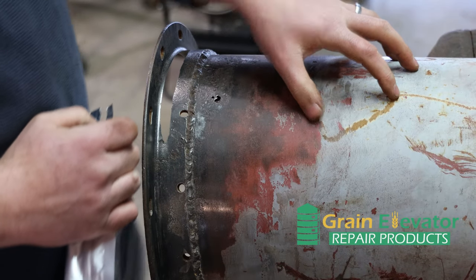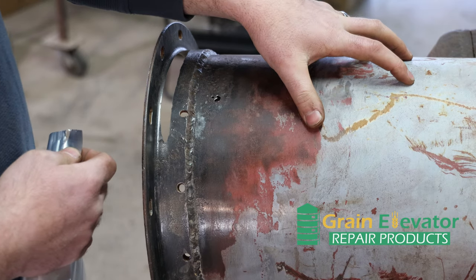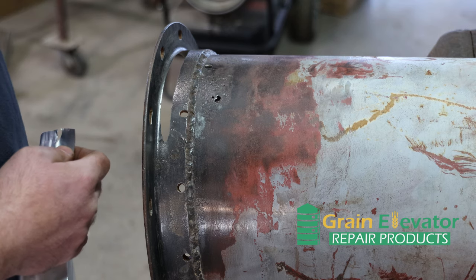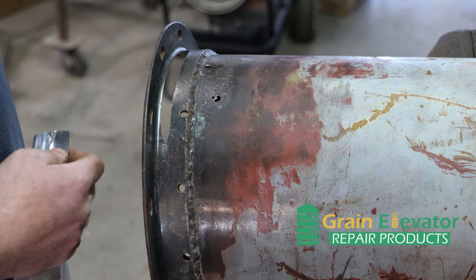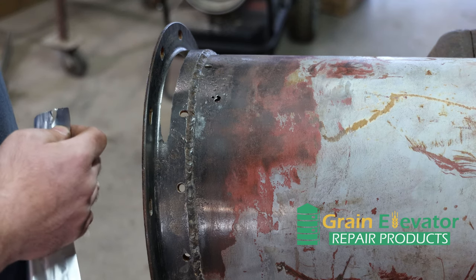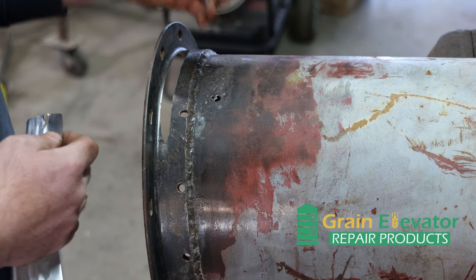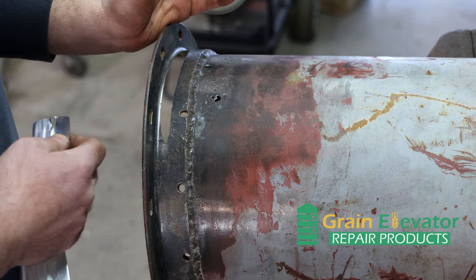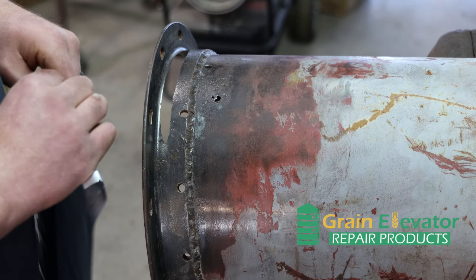What we've got here is a downspout — it's a short section. For the cost of materials it wouldn't be much, but the labor would be very intensive. You'd have to have a crane, because you'd have to have this pipe raised up in position, slide your flanges on each end, weld it in position. You're throwing sparks down your pipe, could get in your bin. The cost of the crane alone is going to be a huge cost, just from the crane sitting there all day waiting on you to weld this pipe up.